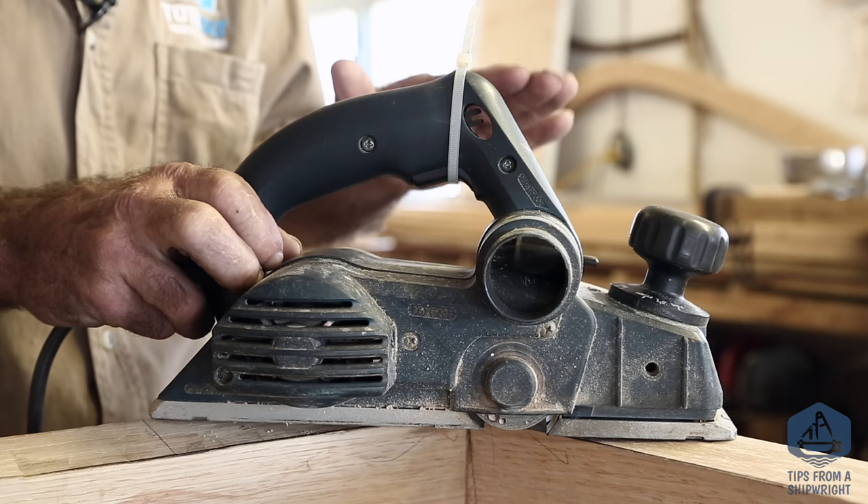Up forward here you can see that the boat is a nice flat-bottom boat all the way up until about 5 feet after the stem, where it has about a 4-inch rise. That'll help keep the bow of the boat up on top of the waves and help it ride a little bit differently. There is some dubbing to do at the chines — we're going to put a pencil line on the inboard side of the chine log just like we did aft and dub it down about 1 degree. We've sawn the chine logs at 5 degrees, but it actually requires around 6 degrees, so we'll accomplish that before we put the bottom planking on later. The next thing we're going to do is get these frames out and get them hanging in the boat.